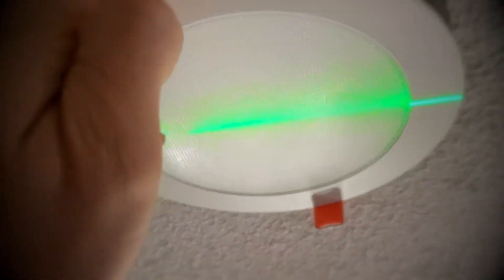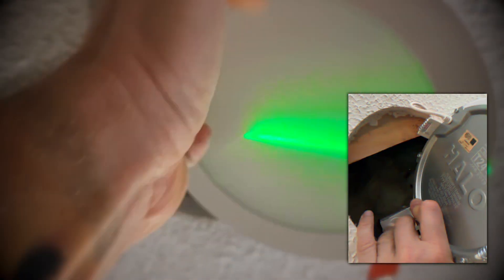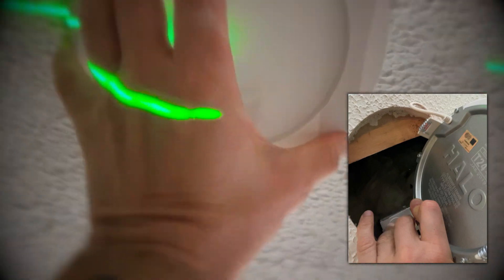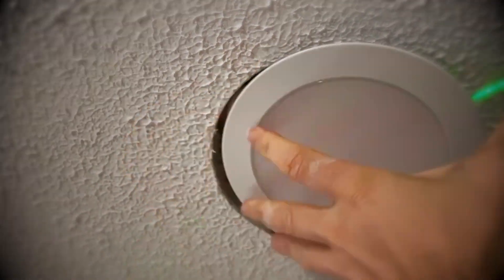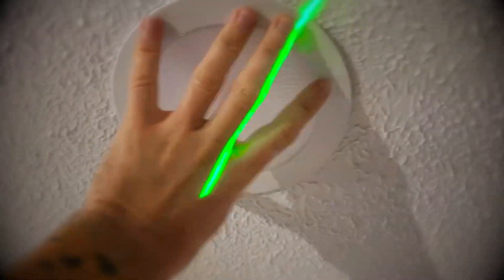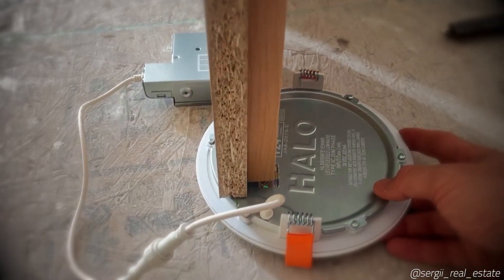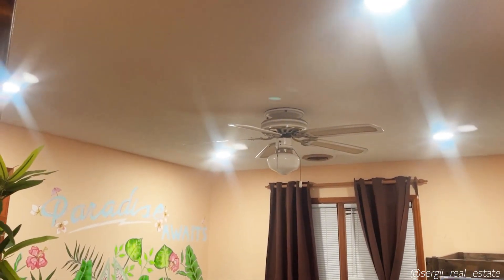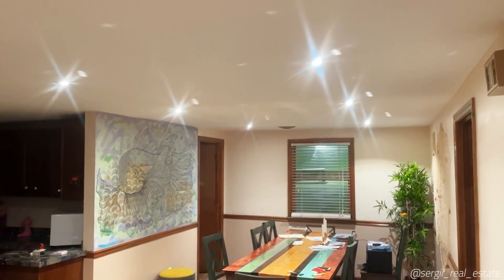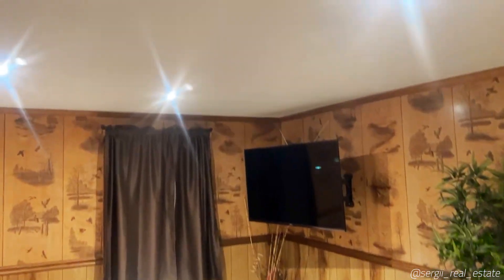If you have a big light like 4 to 6 inches in diameter, you're not going to have this problem because there's no way the joist is occupying significant space of the hole and preventing a snap spring from going through. I hope your projects will come out with nice, beautiful illumination from well and properly installed recessed lights.